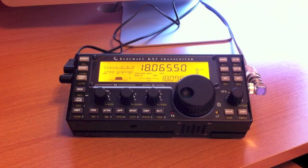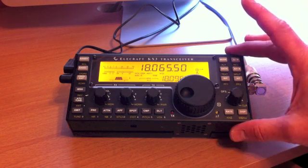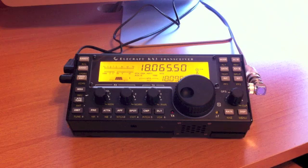That's a minor thing we can live with. The antenna tuner — the ATU unit — works well. I have it hooked up to my Alpha Delta DXEE attic dipole and it tunes very well, bringing the SWR down to 1.1:1 at the radio.